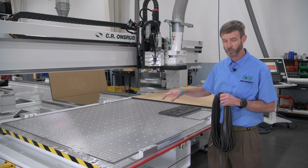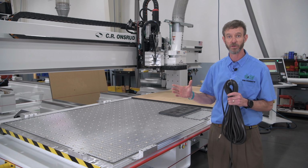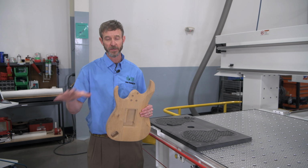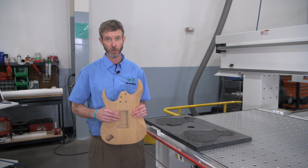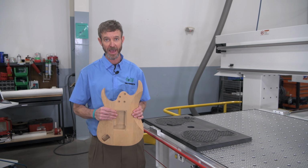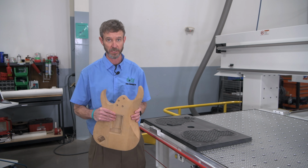And if that's enough under your spoil board or under your fixture board to hold parts, great. But if not, we can look at some different techniques to then start to hold parts with gasketing as well. So now that we've got the table secured with a proper gasket material, it comes down to the part. If you can't hold the part with vacuum, we need to improve that vacuum performance. And how do we do that is with gasket material to make an airtight system.